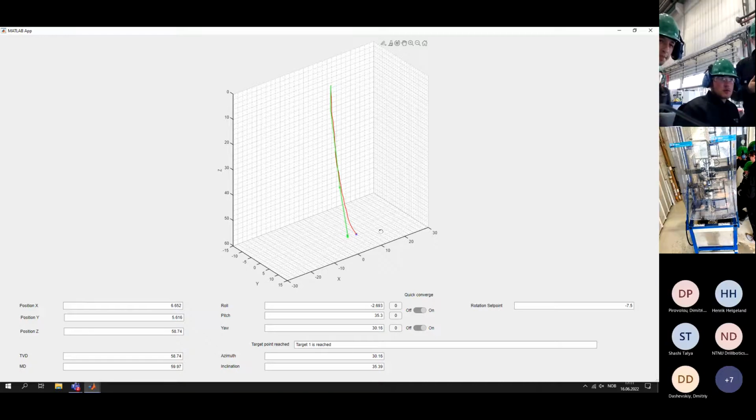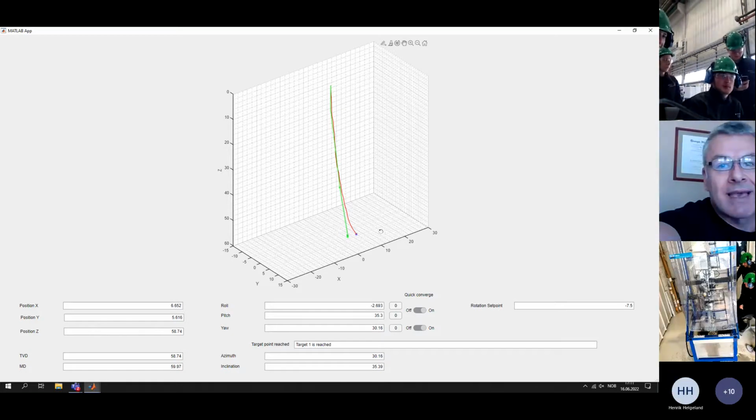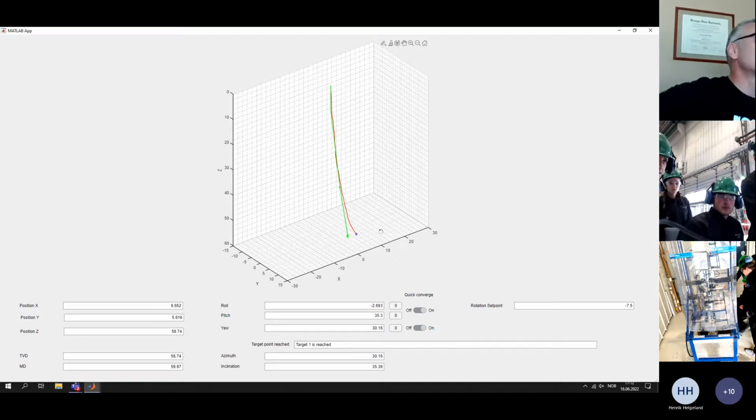Can you repeat, please? We had some technical issues. We're changing to the main computer again. Yes. So if you rely on the readings from the static survey for inclination, azimuth, etc., to calculate the well path, as well as any corrections that you need to make, I assume that the azimuth setting or the direction that you are trying to go is staying constant until the next survey.